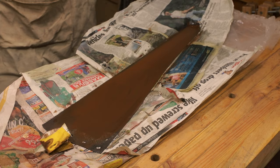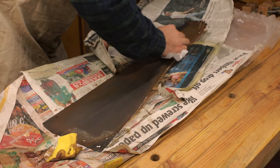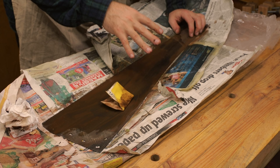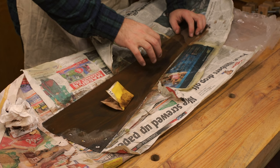I like to keep a little bit of paper towel on hand, just to continually clean it back so you can keep track of how you're going with the rust removal. Now this process is not a quick process — take your time, enjoy the process. You can go much lighter if you need to, if there's an etching on here that you want to maintain. Go ahead and use some steel wool or some very fine wet and dry sandpaper if you can see there's an etching. But in this case I don't see one, so I'm just going to go ahead with this 120 grit until I've removed it all.